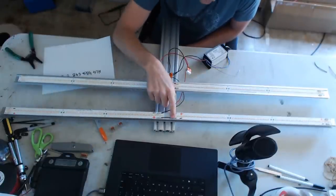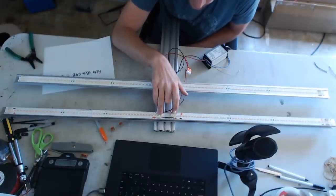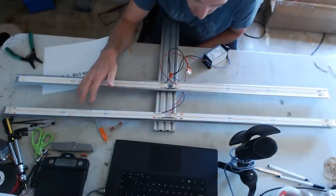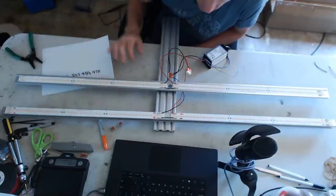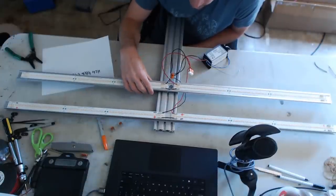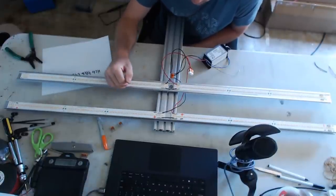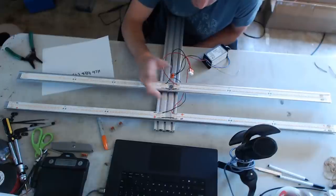The concept is: build 54-volt strips by connecting one strip to the other with a jumper cable to make a 54-volt unit, then connect every 54-volt setup in parallel. Series-parallel will be easy once you have that. As for why we don't make four-foot 54-volt strips — quality control on four-foot strips is poor, they have too much flex, and we'd have to carry too many SKUs. The easiest way is to let you build them up. That's also why we have 27 volts at two feet.